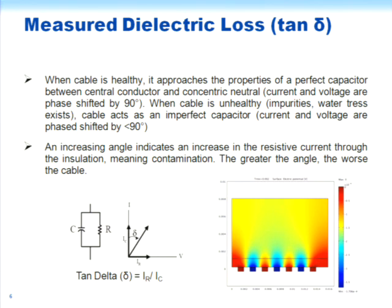Well, it's really useful only when the defects or the changed insulation regions are accessible to you. And they are not accessible, of course, in the major length of the cable run. But one of the things we're thinking about is, if this is a good way to monitor the state of the insulation inside, maybe these things at some point could be built into cable. It's new cable that's going to be put underground.